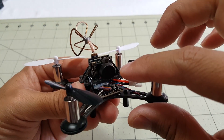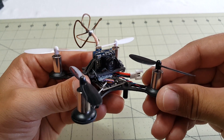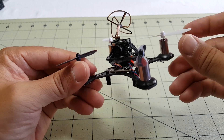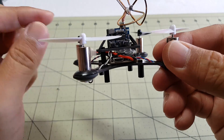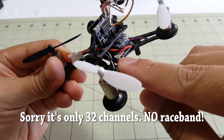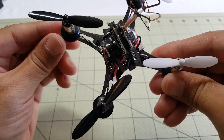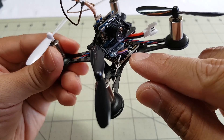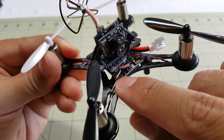They've got one of these all-in-one FPV camera and VTX systems here. It looks like it's got a pretty wide-angle lens - let's see what the field of view is like. I haven't seen this model before; it's not one of the Eachine ones and it's not the FX - it looks like a totally new one. It has dip switches for changing channels, and I'm pretty sure this is 40-channel with race band. Looks like we've got our F3 brushed flight controller at the bottom, and I can see the UART connection and spectrum connector - I'm pretty sure that's the same board.